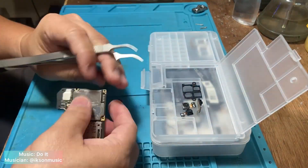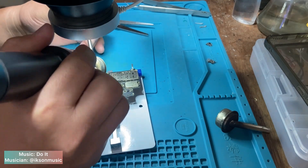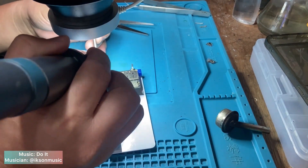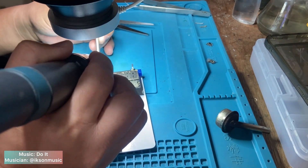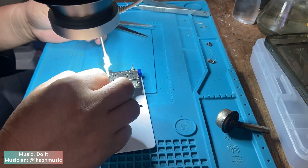Based on my findings, the 1.8 volts of VIO PMU is not present. I already tried to replace the PM IC but the problem remains. So I directly took down the CPU and eMMC to solve the problem, because the signal is connected to them.